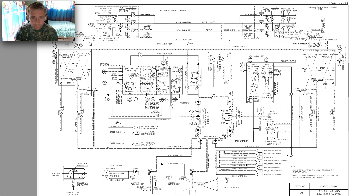We have covered most of the questions about searching the piping. It's really difficult work — be careful when going down through the bilges, not to get stuck, and always inform someone that you are down there. Try to avoid going below the shaft area and flywheel area when the vessel is in operation. Be careful where you are passing and what you are doing, because you never know — there may be cables with bad insulation. Avoid electrical contact with motors and cables as much as possible.